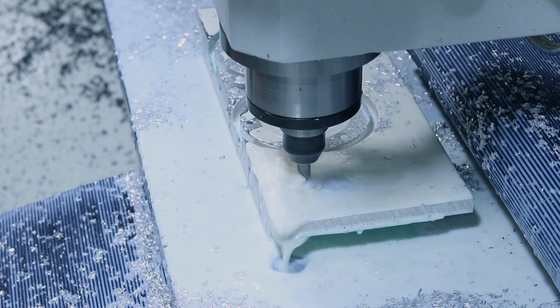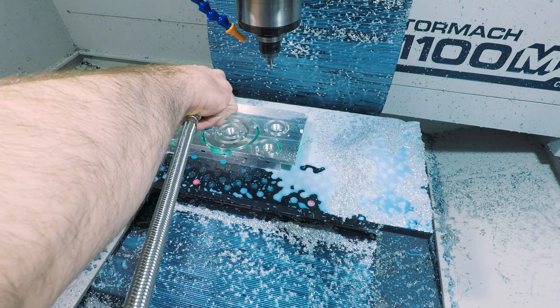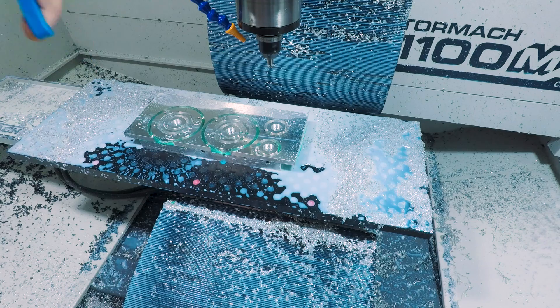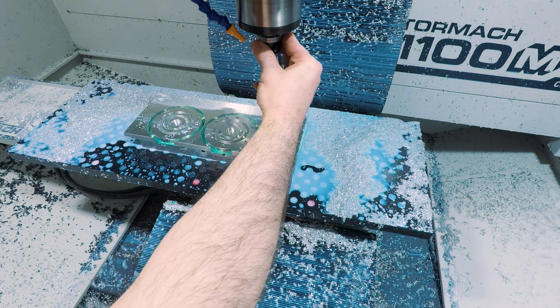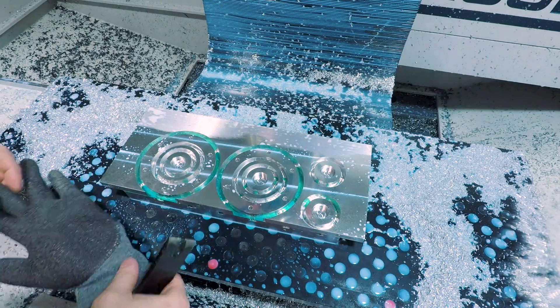These tension rings are almost like washers that go around the mounting bolts for the tension wheel's axle, and we have a small piece of all-thread that pulls back on these rings in order to tension the wheel. I also went ahead and started on these larger rings which are for the tiptoe assembly — we'll be finishing those up in the next installment.